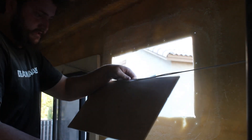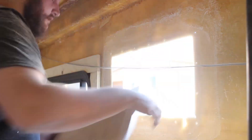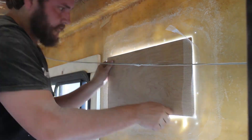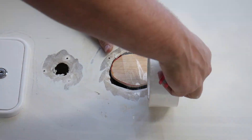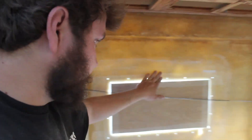So now I'm going to take this wood piece and use some fiberglass tape and tape it on the inside here. I'll be honest, this step was kind of silly and unnecessary, but I wanted to show you me fumbling around with the tape because it's kind of funny. The goal of the fiberglass tape was really just to hold the wood on while we were fiberglassing it. What was more effective was simple packaging tape on the outside — we fiberglass from the inside and remove the packaging tape after it was done and cured. I've got the piece of plywood in there taped from the outside, fiberglass taped from the inside, and then we're just going to lay some sheets of fiberglass over top.